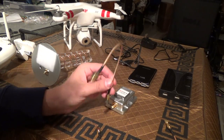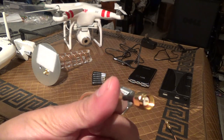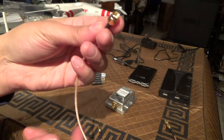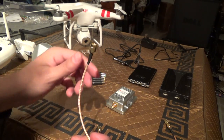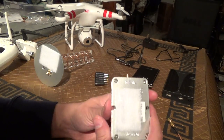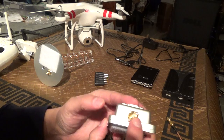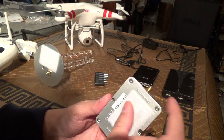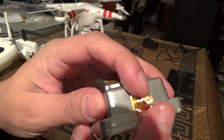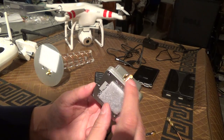It comes with a single cable with an SMA male connector. This is what an SMA male looks like, and this is what an RPSMA male looks like. This is the cable that comes with it. You will need a secondary cable to connect to your antennas. The connector going to the radio on the amplifier is an SMA female, and the one that goes to your antenna is an RPSMA female. It's confusing because you can see the pin there, but RP stands for reverse polarity.